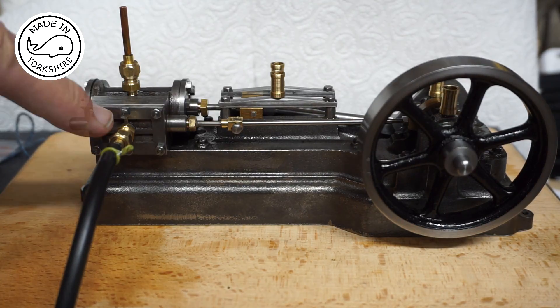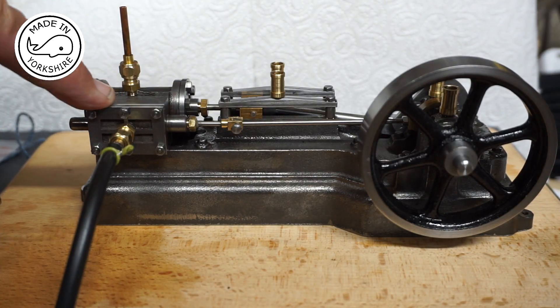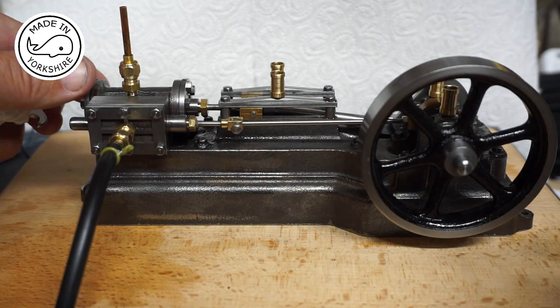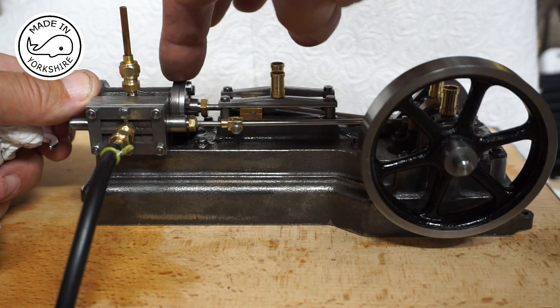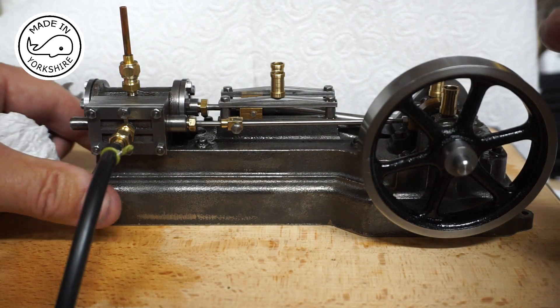You can see here I've got air escaping. I'm not too sure what the solution is there - I mean I've put a gasket in, but I've not put any gaskets on this side of the cylinder, and obviously I've not got any gland packing. I'll give it a try.